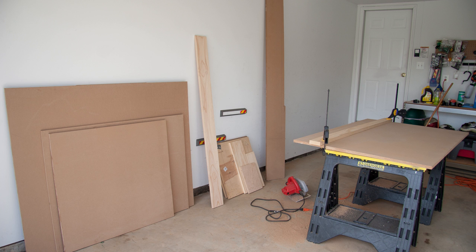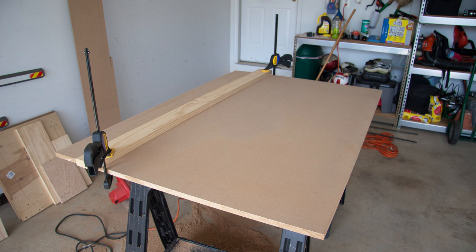You're going to need an area where you can deal with a lot of sawdust because MDF is going to make a hell of a mess. The second thing you want to get is a finished grade 2x4. You're going to use this as a guide to mark the lines on the board for where you want to cut, and also as a guide for your circular saw so that you're making straight and accurate cuts.